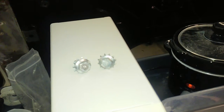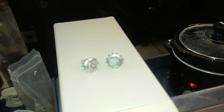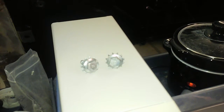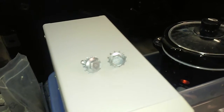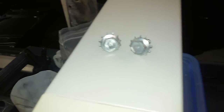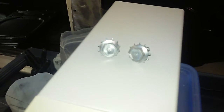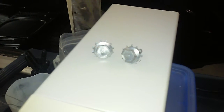It had the amperage setting set too low. If the current is set too low, you won't get a complete zinc coating — you'll get bare spots, and bare spots will come out dull with raw steel exposed, and that doesn't polish out. If it doesn't come out to a brilliant shine, especially when you use the zinc brightener additive, you know you've undercooked it.